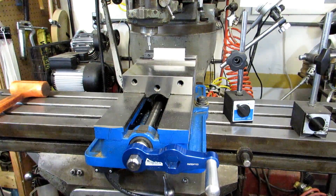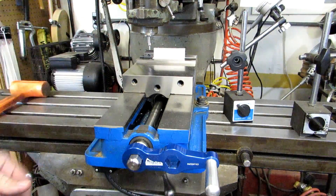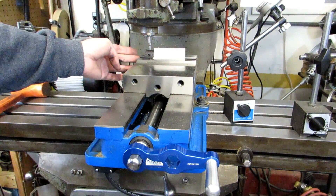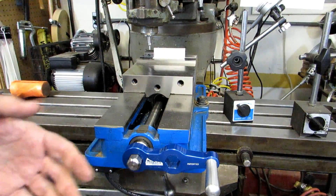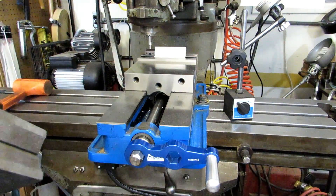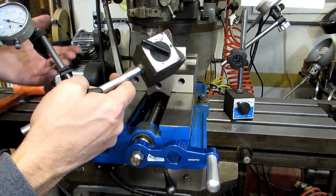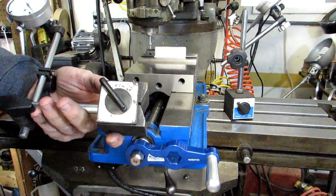I've moved my Y-axis handle up to zero and I'll be able to move in to the correct dimension. I'm going to move to three-eighths of an inch — 0.375 inches — from this back edge, and then I'm going to set my one-inch dial travel indicator to zero there so that I can get my three-eighths-long slot. When you set this up you want to do it in such a way that the indicator is going to be very visible to you. You don't want to have to lean over the machine, so this is going to take a little bit of finagling.